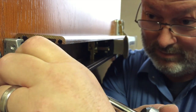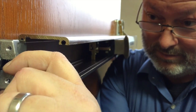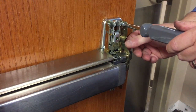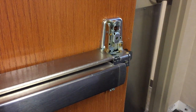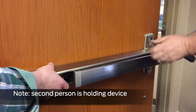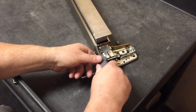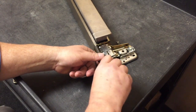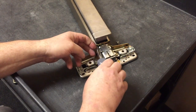It is recommended to hold the device securely to prevent it dropping to the floor. Remove the two screws in the center case reinforcing bracket, then remove the bracket. Remove the remaining screws from the center case, and then carefully remove the trim and exit device from the door. With the straight edge screwdriver or 5/16ths nut driver, remove the two screws from the mechanism case and remove the bracket.